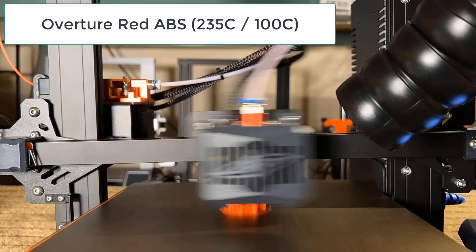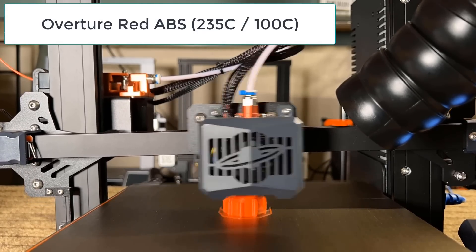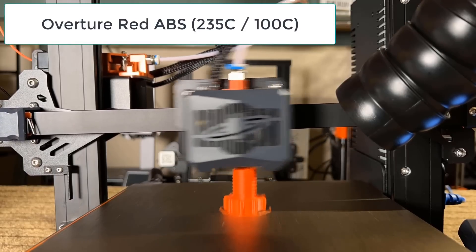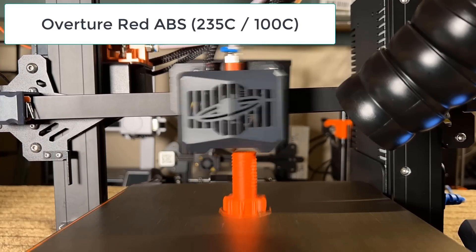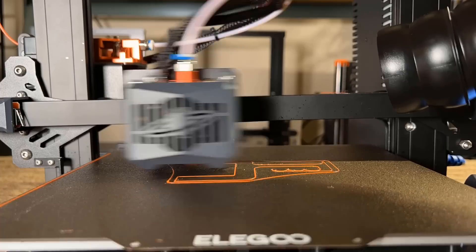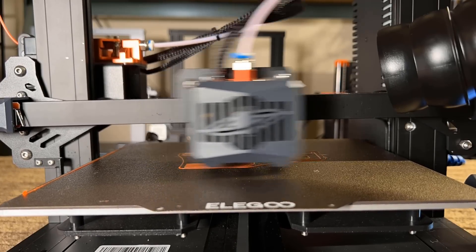I will move the duct in close to the printing area without letting the print head bump into it. I will start by printing this headphone holder, and as this model contains two parts — the nut and the main body — I will print the nut first. This nut looks pretty good. These threads were not printed as well as they could have been with PLA, but overall there weren't any big issues. I will then print the body of the headphone holder, and see if the threads can fit together properly.